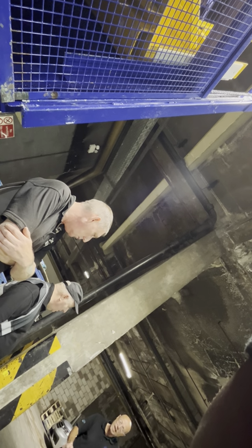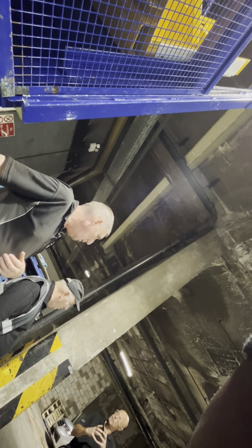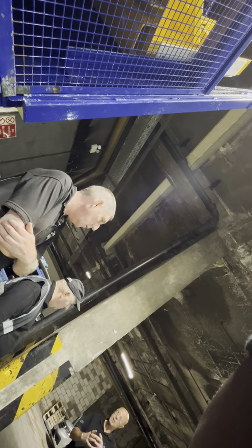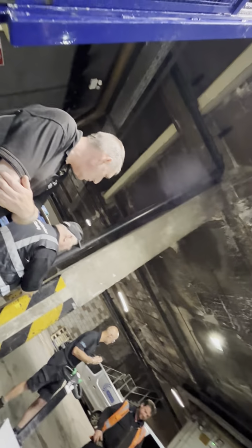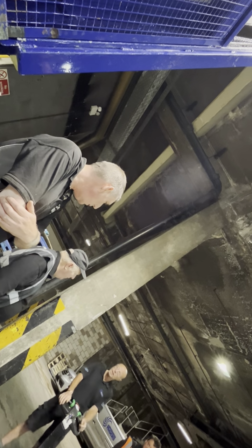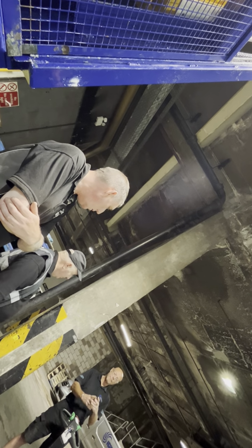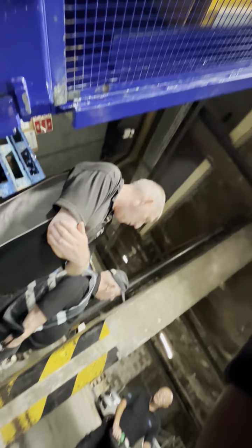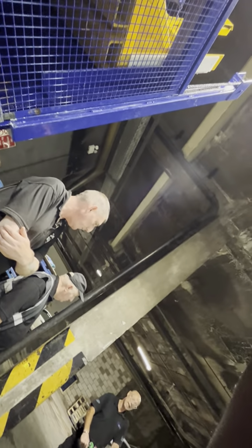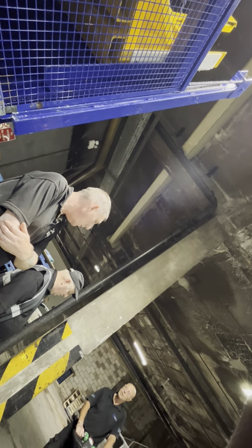The issue you will get is they will spin the rim inside. If the pressure drops, you won't have the bite on the outside of the tyre to the rim, and an engineer will tell you it can spin. Also, when the tyre's flat on one side, it's imbalanced, and it will want to pull you around. So it's always a good idea to do a visual check, but a weekly check on the pressure is always a good idea, just to stay on top of that.